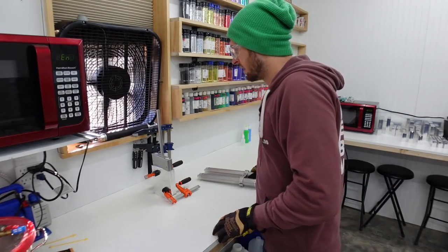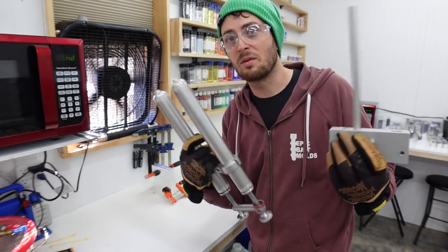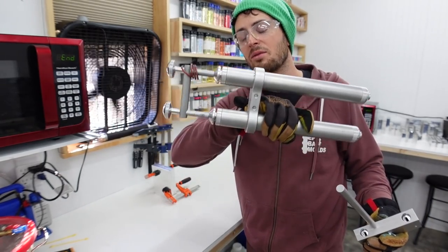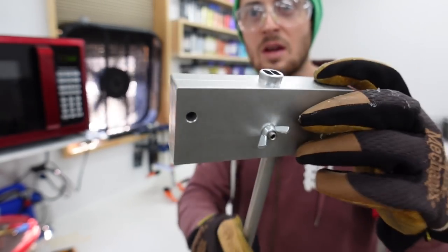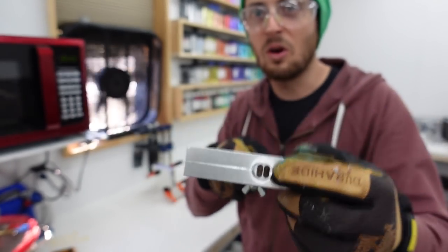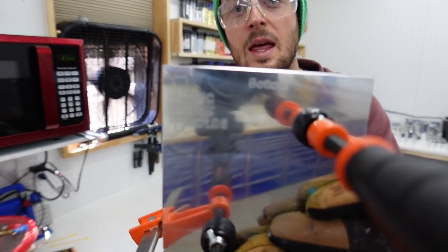Running through there shooting single colors, you will have only one of these tubes. But if you're shooting dual laminates or even triple - a dual has two injectors attached, triple laminate has three injectors attached. You have a dual or triple blending block, or mixing block. Basically it takes two colors in the top and puts them out the single hole right in your injection port.